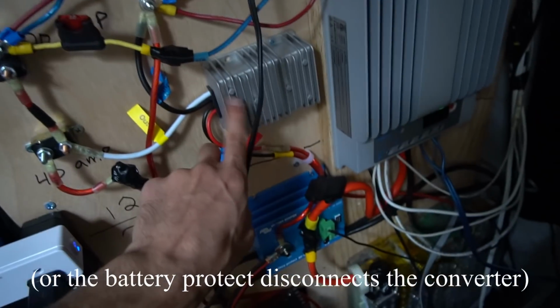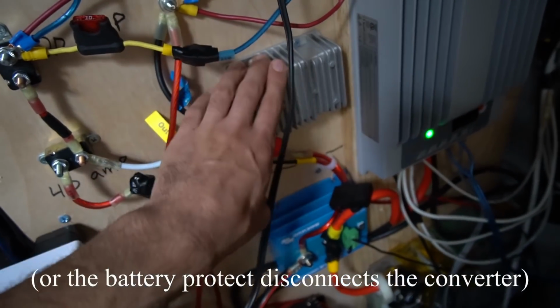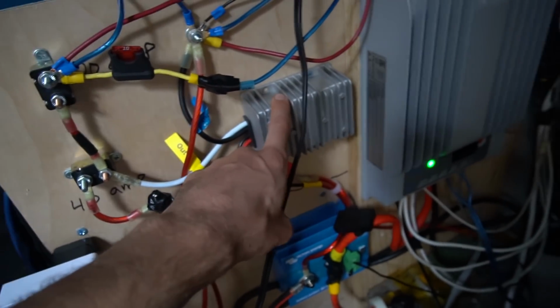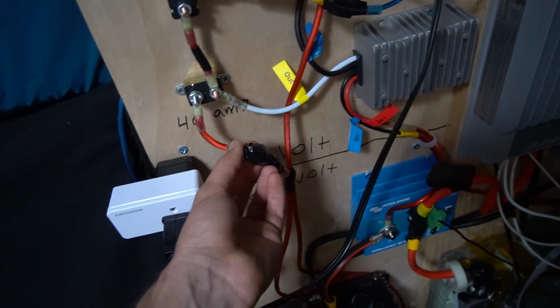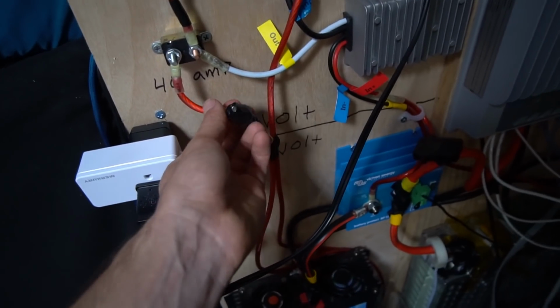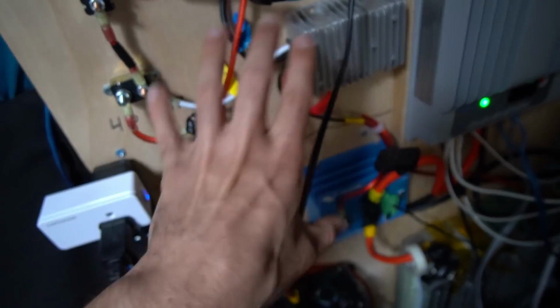Anyways, what this does is that if the Tesla battery is depleted, you're not going to have power going through the converter and back through, because I don't know how protected and how safe this is. I don't want anything burning up and it being backfed. I don't have any schematics for this converter, and most people don't have them for most converters. So having this one diode to separate the converter from the sealed lead acid will ensure that the power will only go to the sealed lead acid and not back this way.